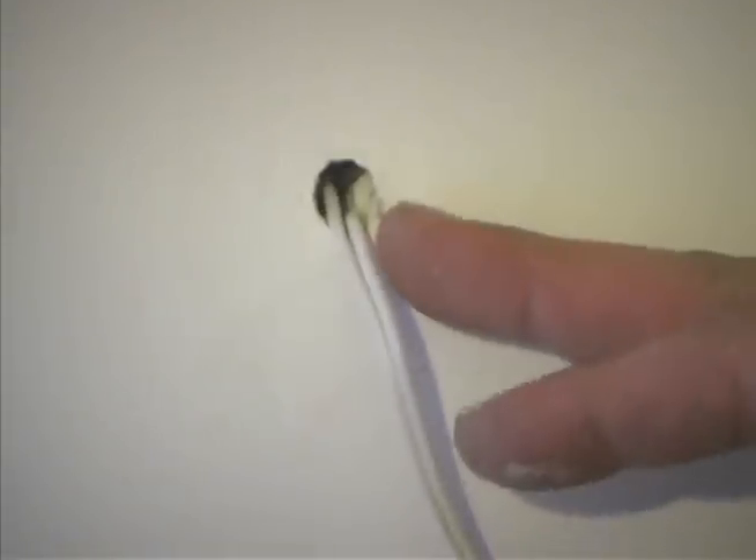Another way of doing this is if you remove the molding from the wall, poke your hole, pull the wire through the hole, run the wire down the wall to where you are going to come up for your AC outlet, and then replace the molding — it virtually disappears.